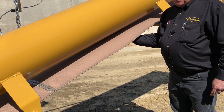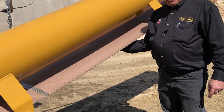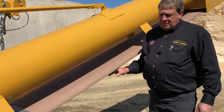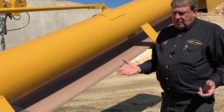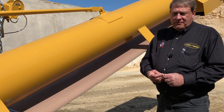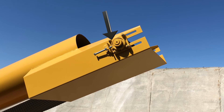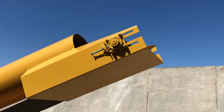To check the tension of the belt, there are several things you can look at. It should take 40 to 50 pounds of pressure for the belt to contact the bottom of the tube. If the belt is too tight, if you look inside the end of the tube, the corners or sides of the belt will want to curl — that's a sign the belt is actually too tight. This does the final belt tensioning as well as the tracking for the top end of the belt, so you can control the tracking at either end of the belt discharge.